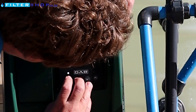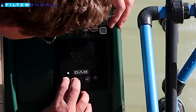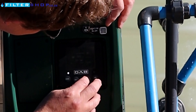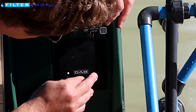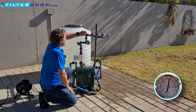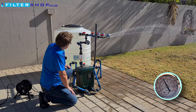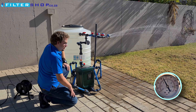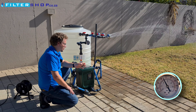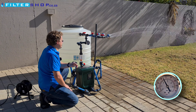To set the pressure you need to press Mode to turn it on, then hold Mode and Set for three seconds, and now we can actually set the pressure. Let's set the target at 2 bar and have a look at how it does. Definitely has a delay to start. Now set at 2 bar, we're overshooting a bit — about 2.3 bar — and with a single shower we're sitting at about 550 liters per hour. Incredibly quiet, and we're only drawing 240 watts for running a single shower, which is incredibly impressive.